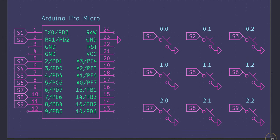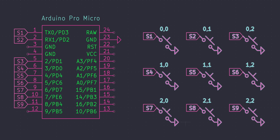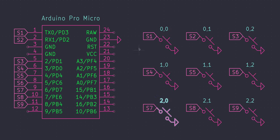We'll take a look at direct wiring and go from there. All we have here is a simple 3x3 macro pad in terms of a direct wired schematic. On the right here we're just looking at the 3x3 grid, and each one of these individual blocks makes up a switch on the board. You can see the two pins for the switch — this is indicating ground and this is indicating a connection on the controller.